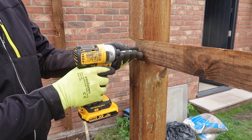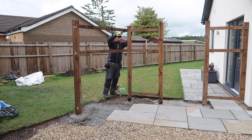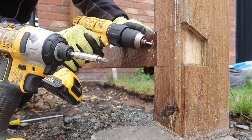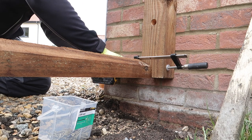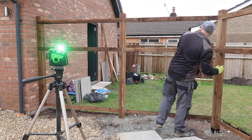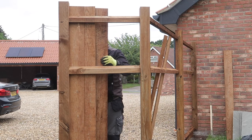With the notches already in the post, it makes it really simple to fix the Aris rails in the right position — there's only one place for them to go. Except for this little corner, which I had to do a bit of playing around with to make it look right because it's not at 90 degrees. I set up my laser level along roughly the centre of the middle Aris rail. This is a good example of using a laser level really as a spirit level rather than an absolute datum — marking the Aris rail means I've got the same level around the whole fence within a millimetre or so.